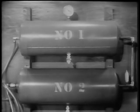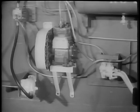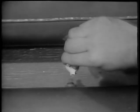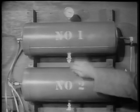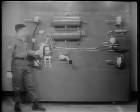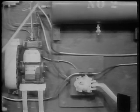As you can see, there are two reservoirs in this air brake system. During compression, the air is heated. As it flows through the lines into the reservoir, the air becomes cool and its moisture condenses out into water. The first reservoir is called the number one, or wet reservoir. It is mainly used as a moisture trap in which nearly all the water can be collected and drained away when necessary. The number two reservoir, the dry reservoir, drains off the remaining water and supplies dry, compressed air to the system. Normally, the reservoirs are drained every day. The compressed air feeds from the dry reservoir through two lines — one that leads to the air brake valve, and one that leads to the relay valve.